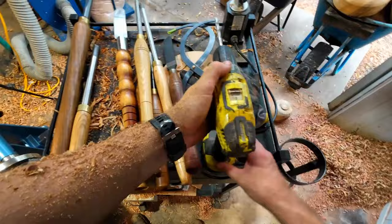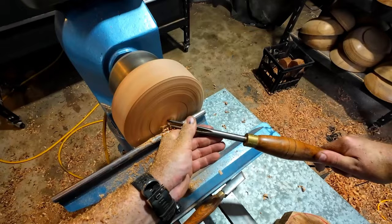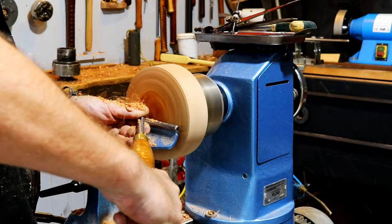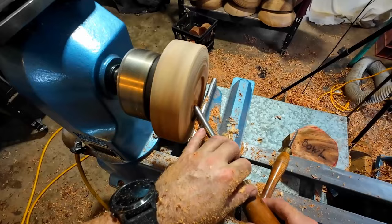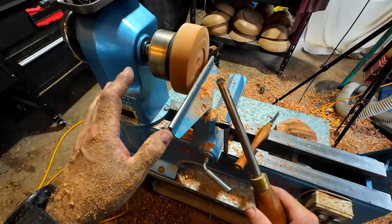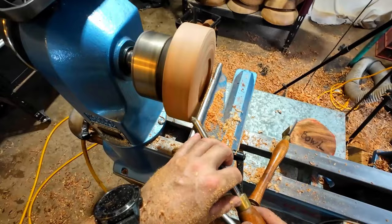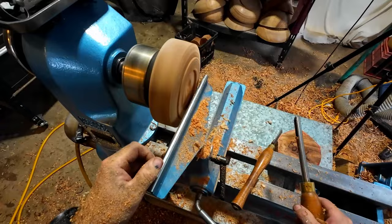These are the tools we're going to use today. I'll show you a scraper later on as well. I've got a little 12mm gouge here — I'm just going to cut back towards myself, then draw the skew into our mark to clean that little raised crown up. Just remember we're roughing out; this doesn't have to be bang on or absolutely perfect. I'm going to take a lot of that waste out, making sure we're running through there. That's an oversized tenon.